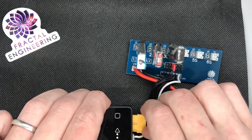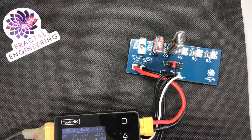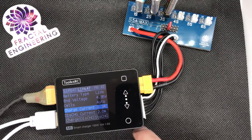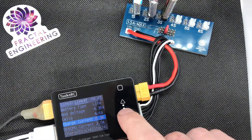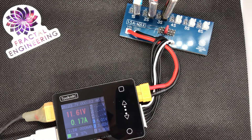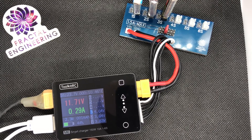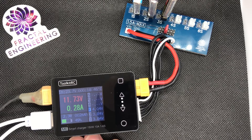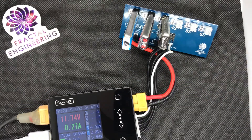Going to start a charge now. These are lithium high-voltage cells, so I'm setting it to 0.3A because they're all 260mAh. Starting the charge — and right there you can see that even though some of these cells have a 0.2V difference between them, it doesn't bother it at all. It's just balancing them before charging them all to the desired voltage.